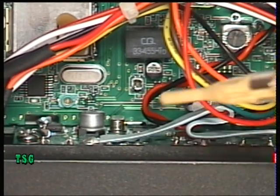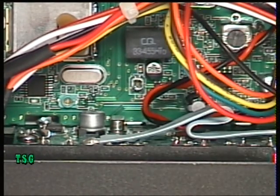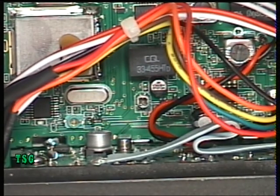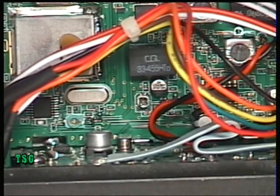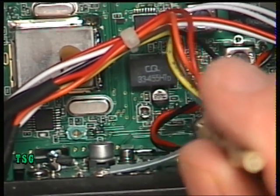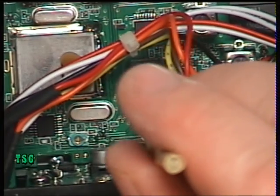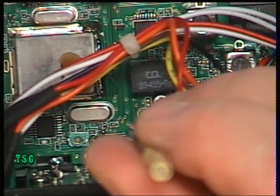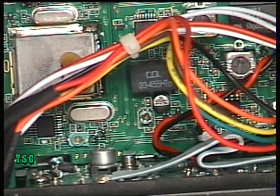The deviation looks like it's going to be this one here — I would expect that's going to be deviation. I'll get the little signal generator out that we hold up to the mic. Out of the box it's doing 1.7 kHz deviation. We've now set that for 2.2 kHz; I don't want it to exceed 2.5 when I do the whistle test.